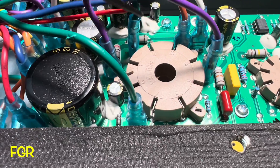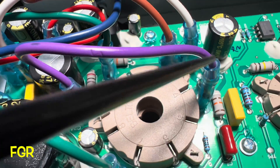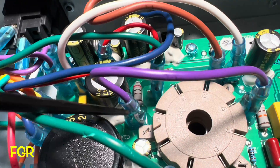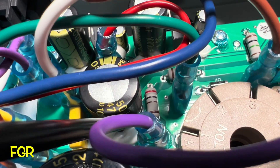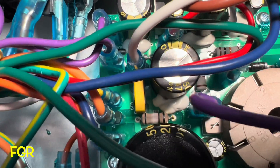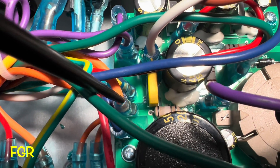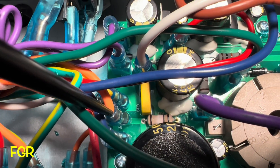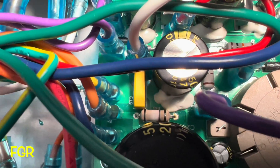Sorry for the shaky camera here — I don't have time to take my stand out. Pin number 4 here is what I was referencing before: this is the screen supply node on this tube socket. It's connected by this jumper over to the rail over here, purple wire down here. There's a dropping resistor — that's not an issue. What is an issue is this guy here. This is right off of the standby switch, comes off of your reservoir cap as the first B+ node, and power goes down the rail to the next filtration stage for the screen supply.